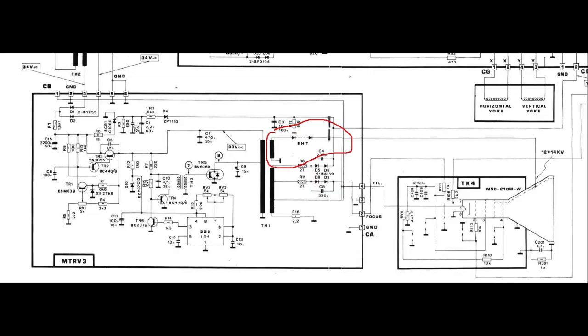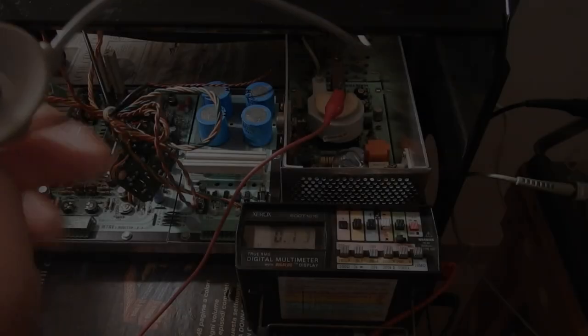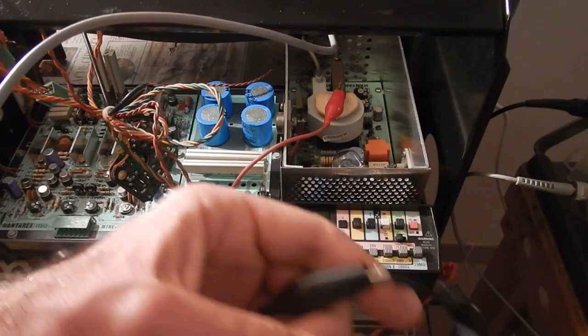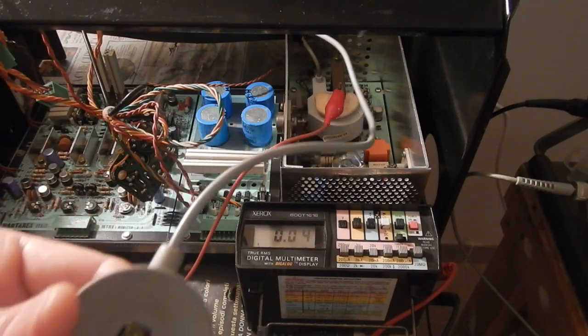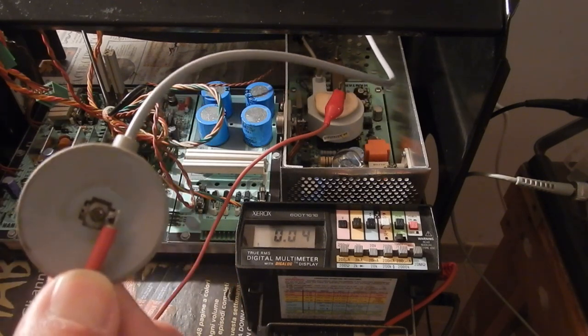I'm going to use a 14 volts power supply to test this diode string, but a more useful voltage for diodes used in color CRT supplies would be 24 volts. The red clip connects the power supply positive to the transformer ground. The power supply negative is connected to the voltmeter negative probe. And last, the positive meter probe is connected to the anode cap. This way we'll test the diode forward drop.